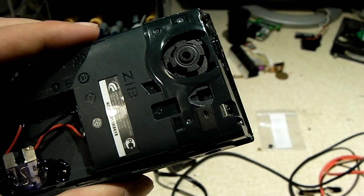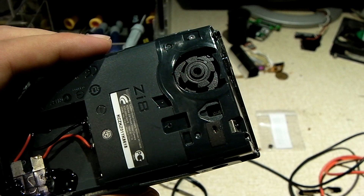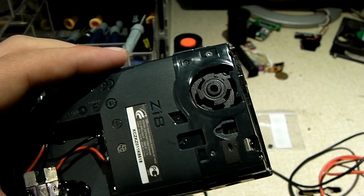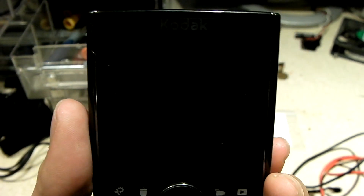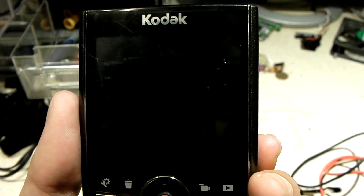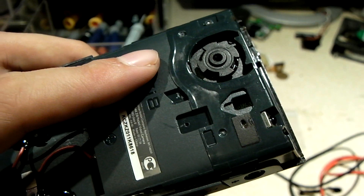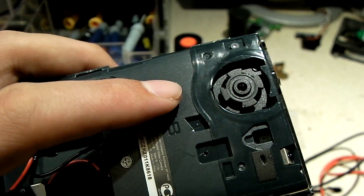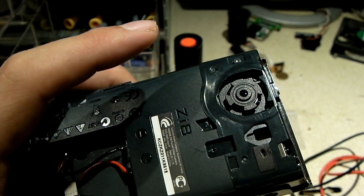I was able to get it pretty close as far as the focus goes. However, I'm going to wait until tomorrow when we have more light outside so I can get a better idea of exactly where I want it and fine-tune it. A good measure of focusing with these things is to load a card and shoot a few clips of video. Because the 2.4-inch display on the back just doesn't do it justice when your video is 1080p. You get a lot better resolution when reviewing it on a computer. So a good idea is to put a card in, record some footage, stop, twist it a little bit, record some more footage, until you have it exactly where you want it. That's just a general idea of how you can focus or refocus a fixed focus camera.